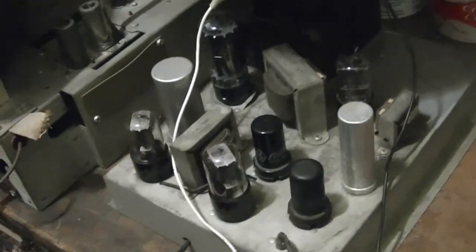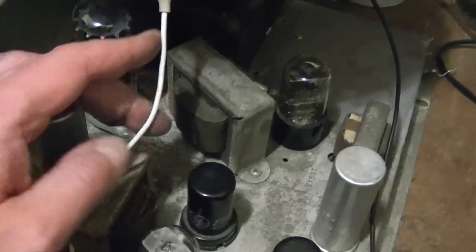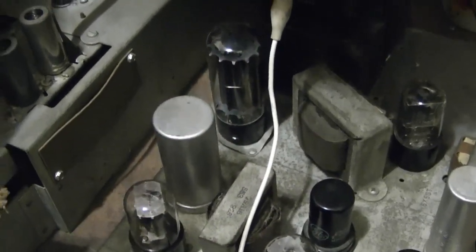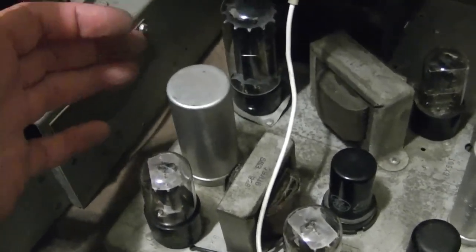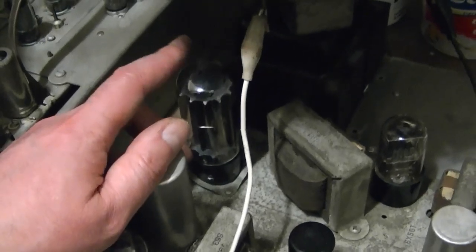I've finished recapping the lower chassis. I suspect it won't make a whole lot of difference, but perhaps the sound will be a little clearer. Something else I want to check for is any flashover in the 5U4. I've had this problem in some other Admiral sets — I'm thinking maybe the new caps have much lower impedance, so when you turn it on there's more of a surge current and you get a little flashover, some sparking inside the 5U4. So I've had to add a little resistance in the B-plus circuit to provide a softer start. I'm going to turn the lights off so I can check that 5U4. No, I don't think so — it looked okay.